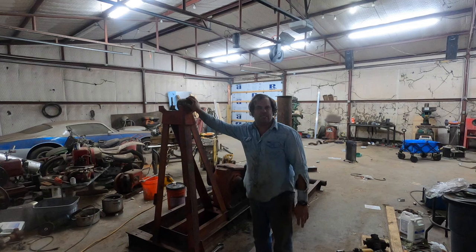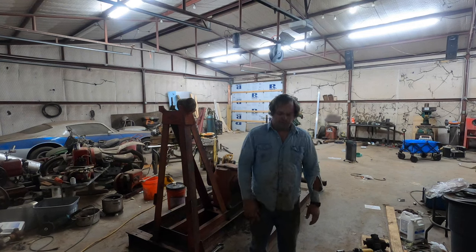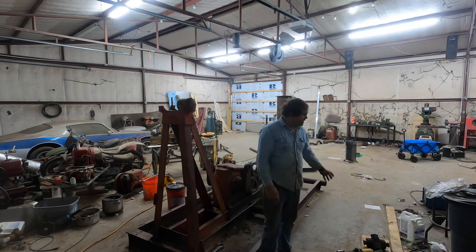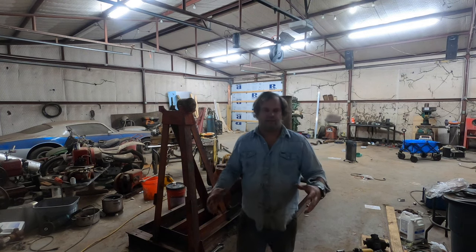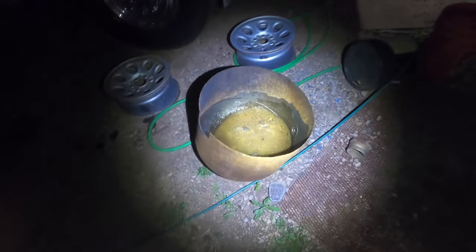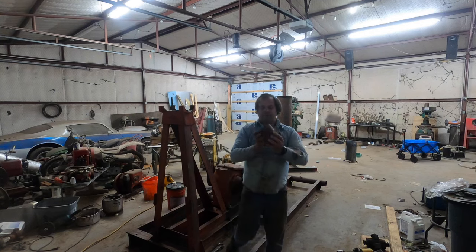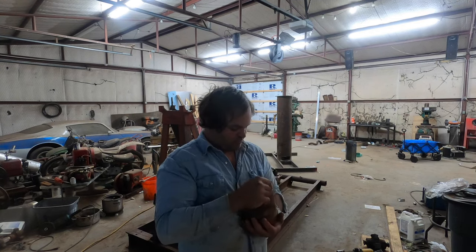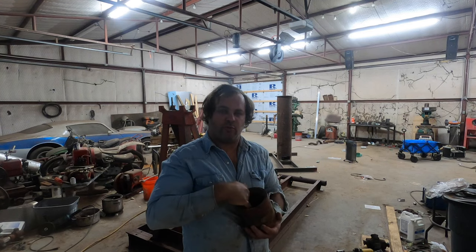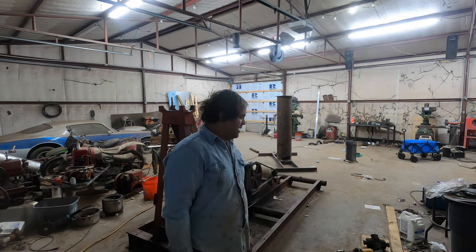First things first, when I bring these bearings in they're always covered in grease, caked up with grease and dirt. They're really difficult to clean. What I'll do is pull all these bearings apart and take the housings out to a little fire pit I have out there. Throw some wood in it, throw some gasoline in the bottom, light it. I'll use a few greasy rags, and then throw all the bearings on top of it, set it on fire, and get a good fire going, and the fire will burn out all the bearings. When you get done, you'll have a kind of crisp stuff on there that you can brush off with a brush or whatever. They come out really clean. That's the easiest way to do it. Just build a good fire, throw your bearings in it, and then come back the next day and they'll be nice and cool.